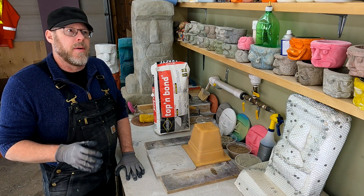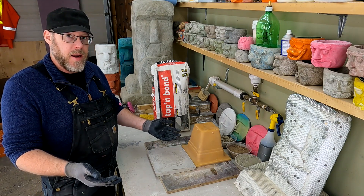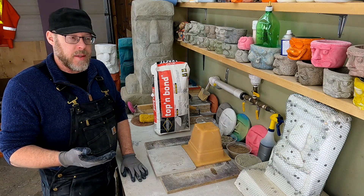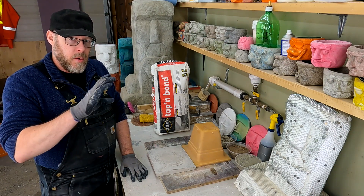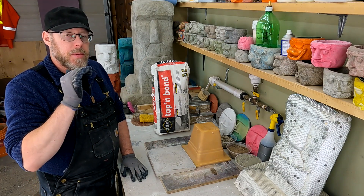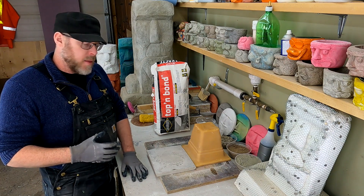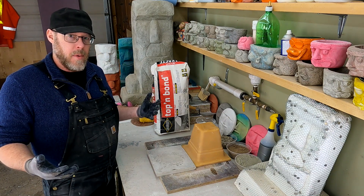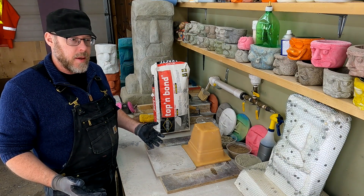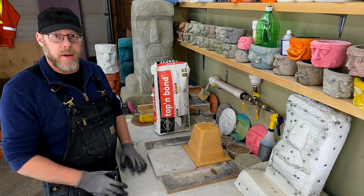The thing about an overlay is it's not as good as if you poured the concrete fresh and did stamps or a texture to it. There will always be the old concrete, the new concrete, and a potential plane for delamination between the two. In theory, the product is so heavily modified that it should bond to almost anything, but still, it's not as good as uniformly poured concrete.